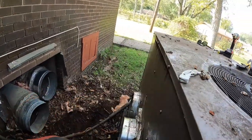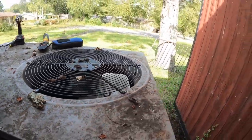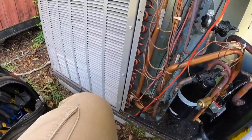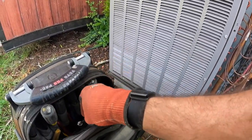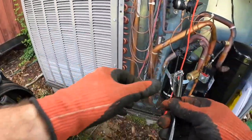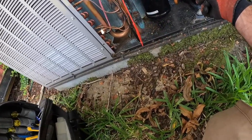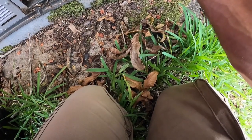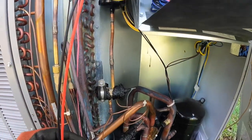So what I'm going to do, instead of taking it out, is I'm going to come look at this fan motor. And it takes a 10 microfarad cap. It's right there on the side of the label. And then I'm going to look on the label of the compressor. And of course, it's facing towards the inside of the unit, so can't see it either. But I have my handy little mirror here, so I'll see if I can't find it. And sorry for the camera angle here. This is a 70 microfarad, so this capacitor should read 70 on the hermetic side to common.